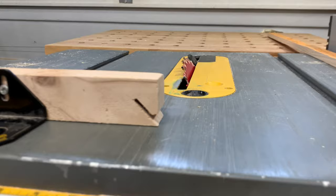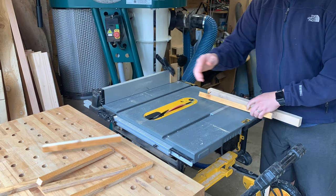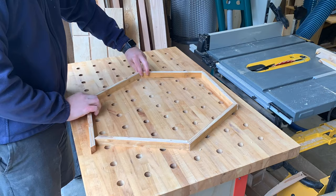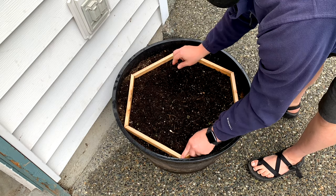You can see it is 30 degrees — we've got the bevel. Really important: make sure you switch that back after you're done. I do recommend doing one test run first, so just do six pieces to begin with. Again, you've seen that stop block; I'm standing to the side trying to be safe. Then test it out — is it the size you want? Does it work? Did you get the angle right?